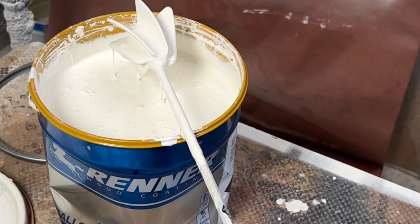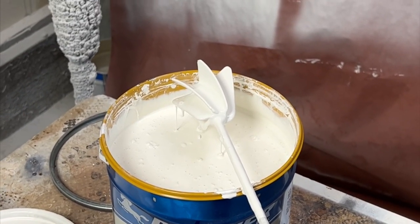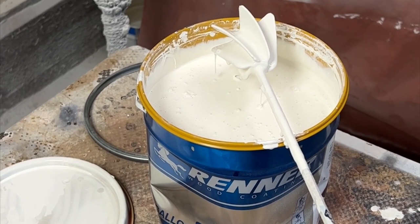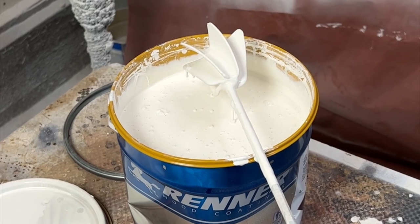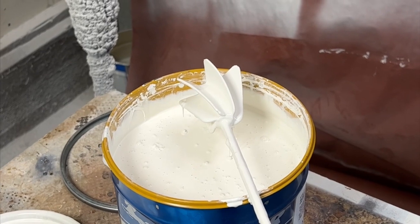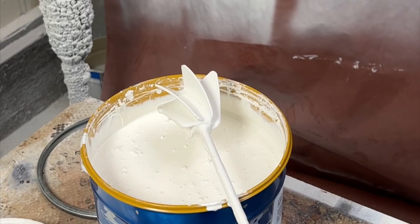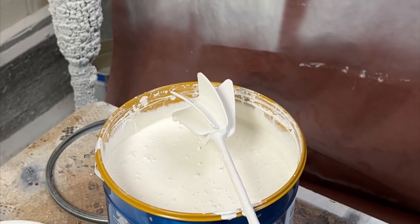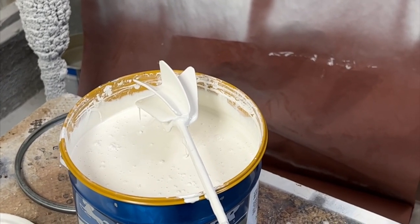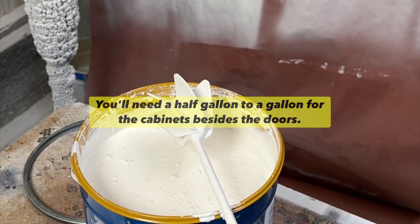So that means you can calculate how much paint you're gonna need for a kitchen. If we do a maximum of four coats of top coat — two on each side — that would be 80 times four. 80 times two is 160, 80 times four is 320, and that's roughly two and a half gallons. Usually three gallons of paint does a kitchen for me — that's pretty much what I get for an average size kitchen and there'll usually be just a little leftover.